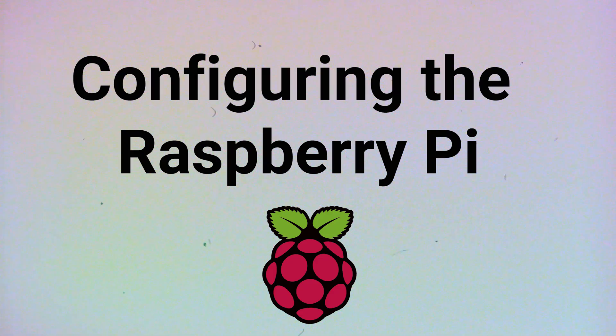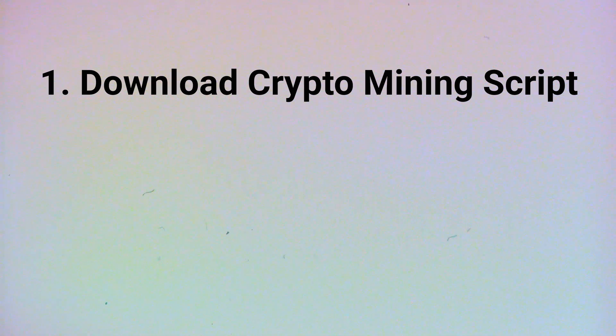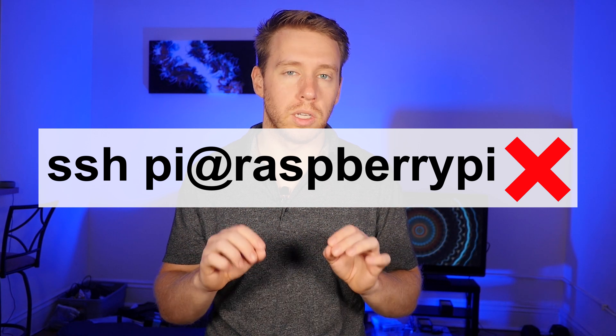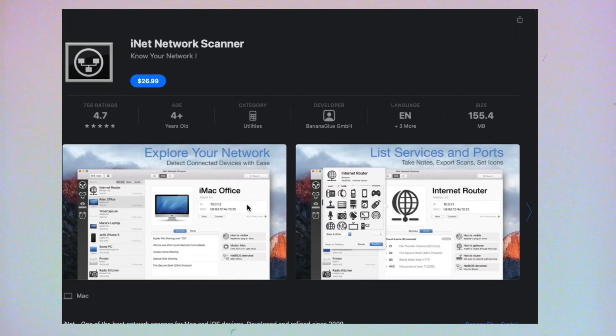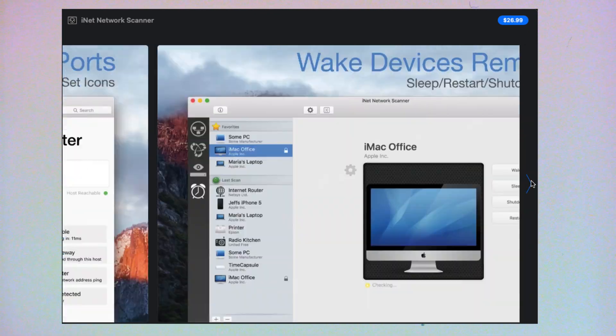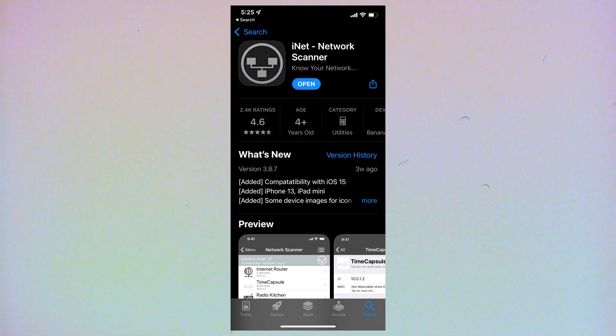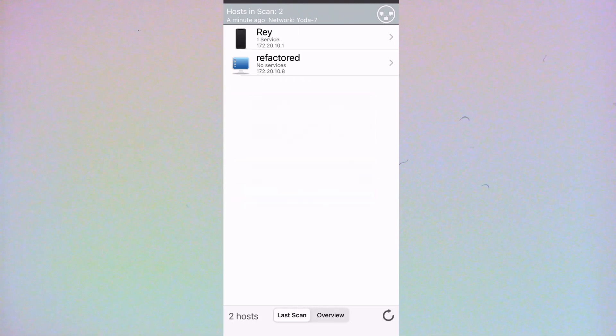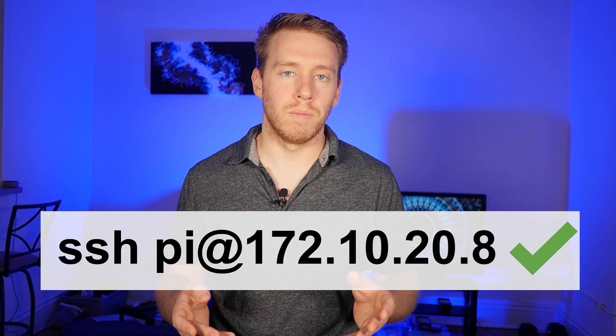Two steps before we bring the Raspberry Pi out to the stream: one, download the crypto mining software package to the Raspberry Pi; and two, make sure the Raspberry Pi will automatically connect to our mobile Wi-Fi hotspot. One issue I had using the mobile hotspot was I could not connect to the Raspberry Pi over SSH using the hostname, so I downloaded a tool to my iPhone called iNet, which is an IP address scanner. With both devices connected to the hotspot you run the scanner and it shows you the IP address of your Raspberry Pi, which you then use for SSH instead of the hostname.